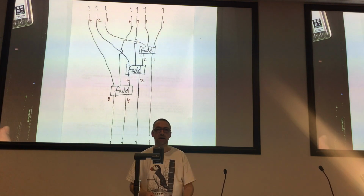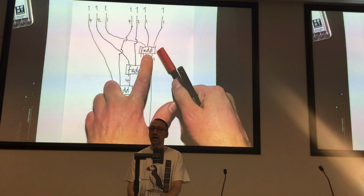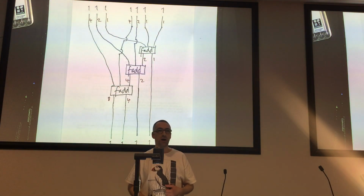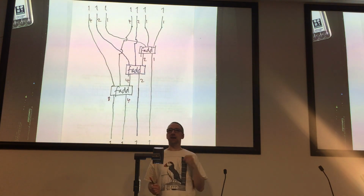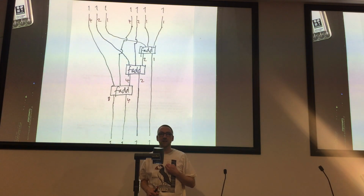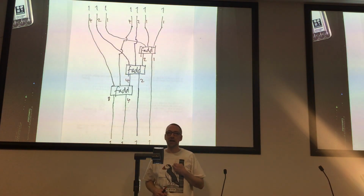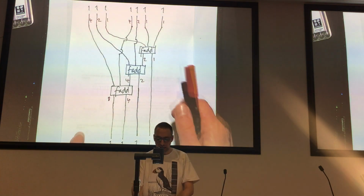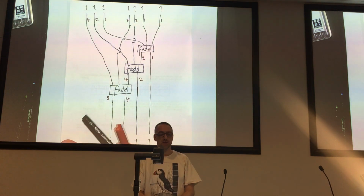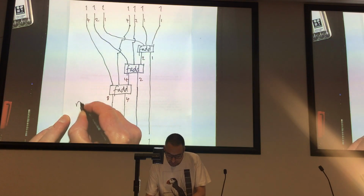And you can see that it is constructed just by using a full adder to do exactly 1 column's worth of adding up. So if you've got 2 inputs and a carry coming from the previous column, a full adder gives you exactly the right circuitry to produce 1 bit of output and send a carry to the next column. So you can keep this going sustainably for as many bits as you want. This circuit is called a ripple carry adder.